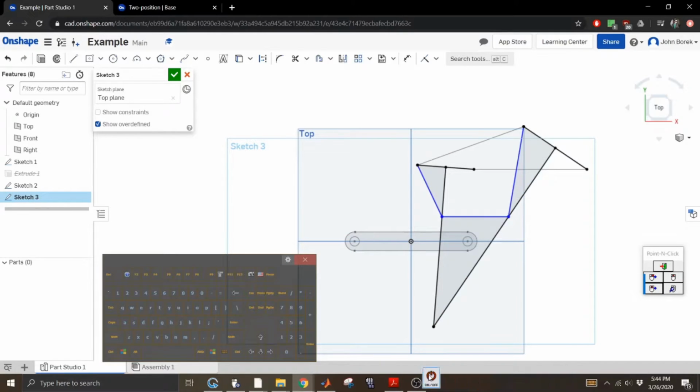All right, so let me just recap. We have our two position constraints. To figure out the pole, we connect the two endpoints and then draw lines until they intersect. This is our pole, which essentially means this line is going to rotate about this point. And once you know that you're going to be connecting directly to the coupler, that already tells you where your moving pivot locations are going to be. And all you need to do is find your fixed pivot.